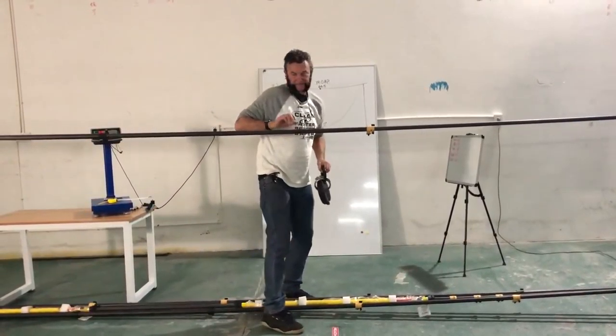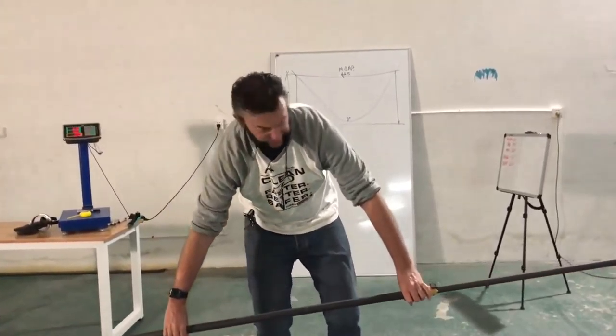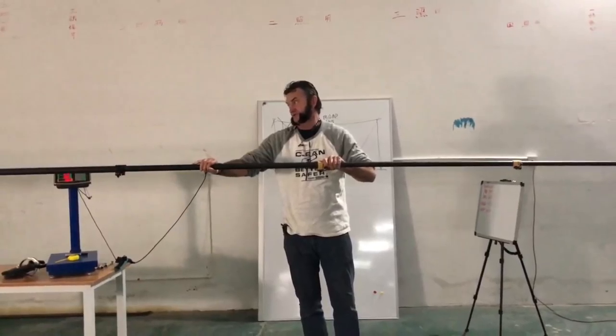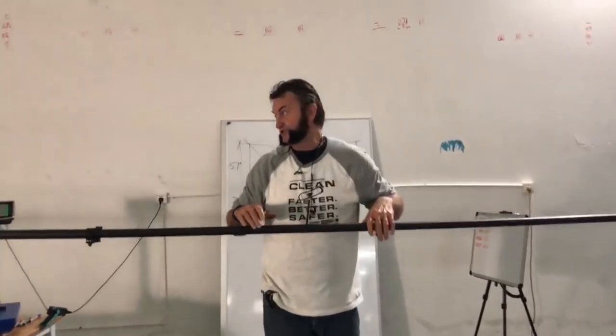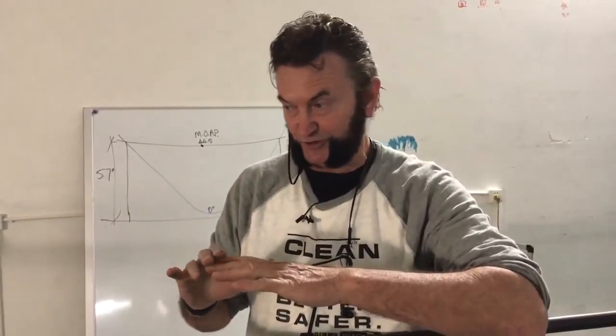Now, we'll take that off and we'll go to Reach It Mini, which has been our flagship pole for the last 5 years. Now, Mini's made from a lower modulus. Modulus is the relationship of weight to rigidity. So it's made from a lower modulus carbon fiber, because it's a pole that's designed for two-story work to be crazy rigid, but it's also over-designed in a way because it can be extended with plus A, plus B, and plus C up to 55 feet reach. So when you buy a two-story Reach It Mini, you've bought the ability to reach 5 stories, so we have to manufacture it so that it can reach 5 stories. But it's not as rigid as a Reach It Pro or a Warrior, which is coming out, and it's not as rigid as a Procision, because the Procision and the mother of all poles have to go to 80 feet. So we have to make it out of a higher modulus of carbon fiber.